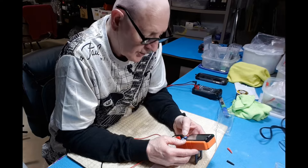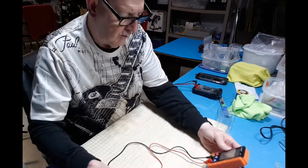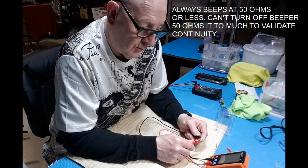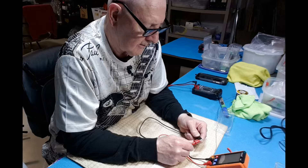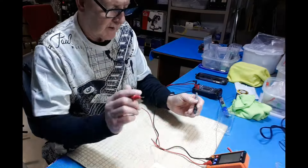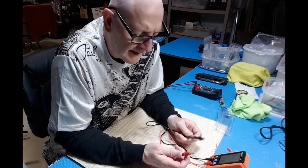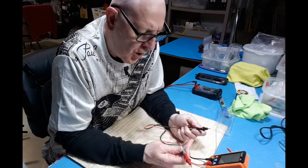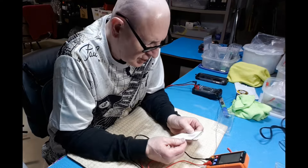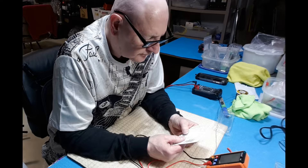Let me select voltage. There should be ohms on here — let me see if I get a zero in auto mode. Zero ohms and a beeper on this one always helps when you're doing continuity so you don't have to keep looking up. However, in the past these meters are usually never really at zero ohms — there's usually a lower number, so that's something you'd always have to check for.